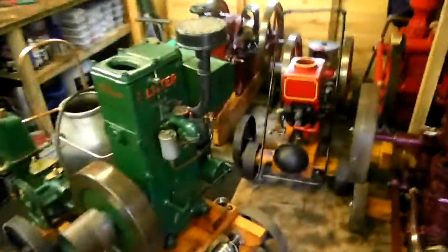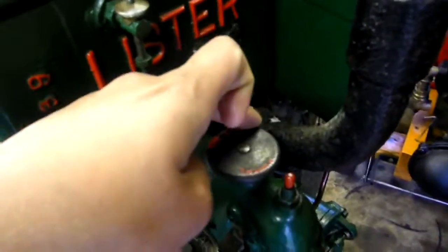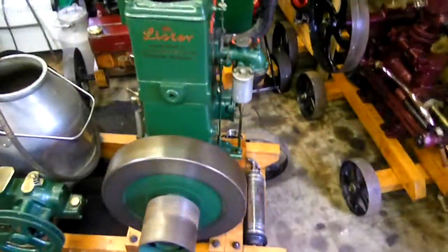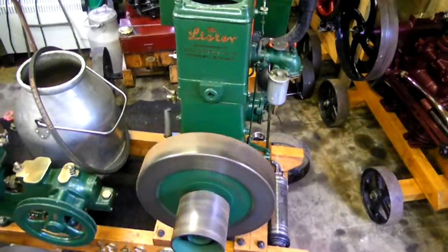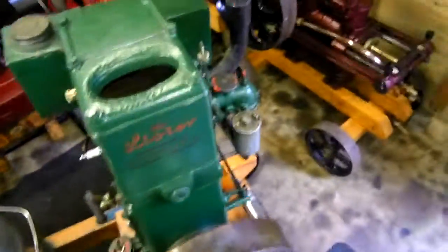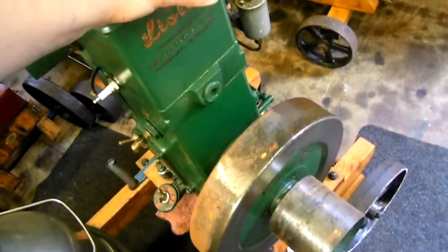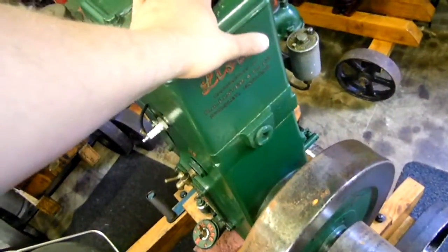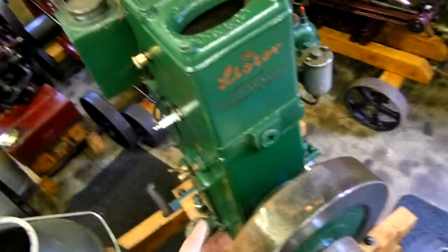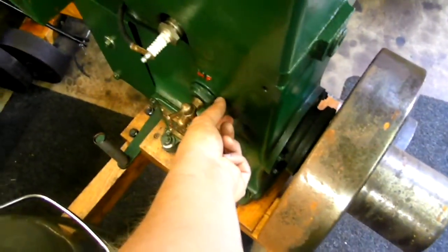So I'm going to shut it off a minute. You can turn that tap sidewards — obviously there's no fuel in it so we don't need to do that. Just screw that one back around there like that, turn that off to stop. Your fuel line's off. It's starting to build compression up a bit. Normally if this was for water and it was running for quite a while — a few hours or so — it'll obviously be steaming away. So once you shut off, just let the water cool down. Don't try draining it while it's hot, because if you drain it too hot the casting can cool down too quick and it'll crack. There's almost a tap there where you drain out, but you always still have about an inch of water in there.